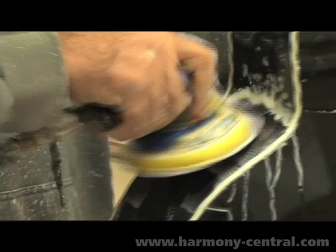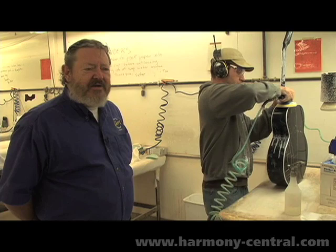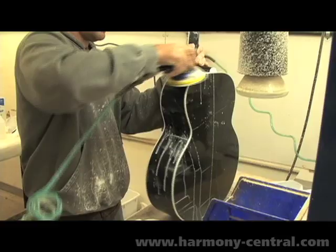We use a small amount of liquid dish soap in the water to aid as a lubricant in the sanding process, so that the lacquer that is sanded away does not have a chance to reclump, dry, and burn the finish in a circular pattern. If the correct amount of sanding is done, we leave a perfect sheen over the guitar at buffing.